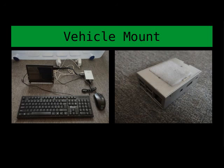Also, when you're doing the installation, I do recommend plugging it into wall power, because you don't want the installation to take too long because you want to do some extra steps, and then you don't have enough power to run you all the way through. Because like I mentioned, if you plug that USB power bank into a wall while it's running your Raspberry, many of them will just stop powering your Raspberry, and that's bad on a Raspberry. You don't want to shut them down.